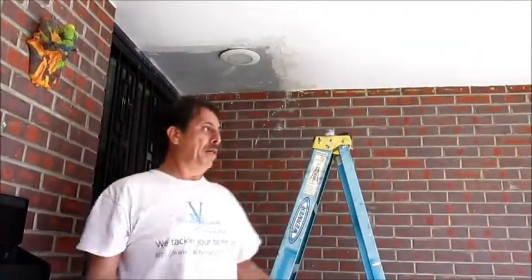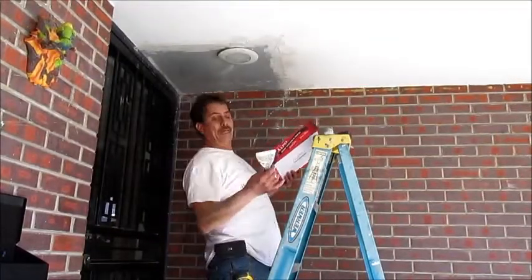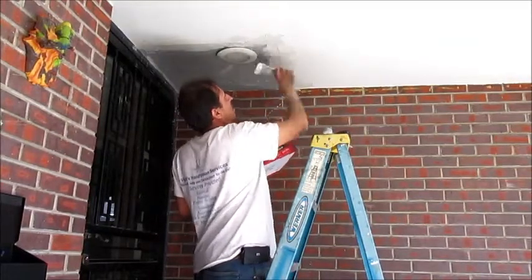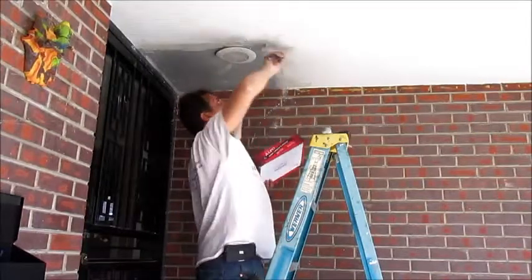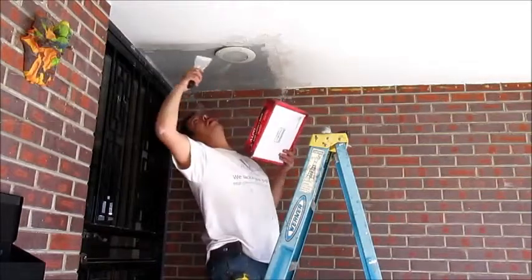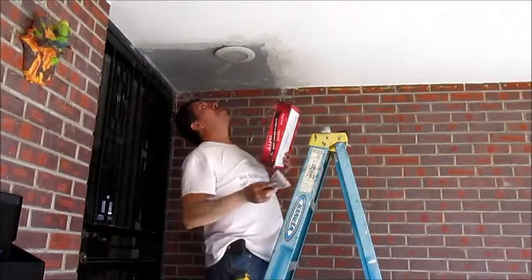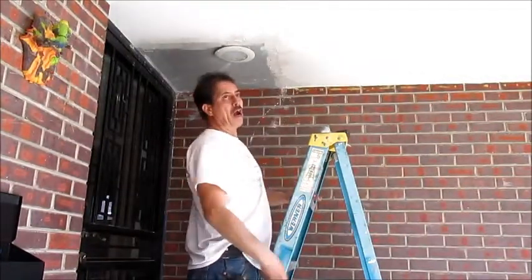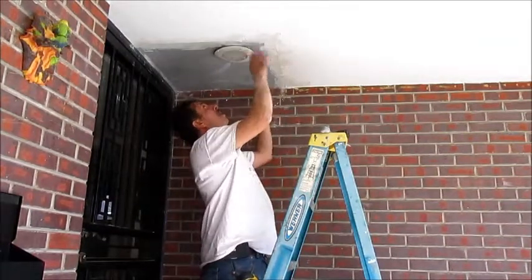Okay, I'm back. Now we're at the mudding stage, or joint compound stage. What you wanna do is, you just put it all over, you just follow the line. You just follow the line, see? Just put it all on there. I'm using the fast dry joint compound, or I like to call it mud. Now I'm gonna let it all dry.